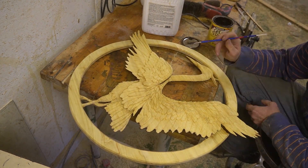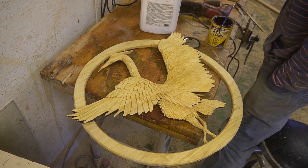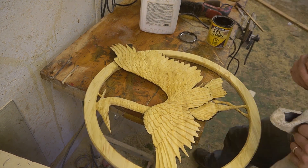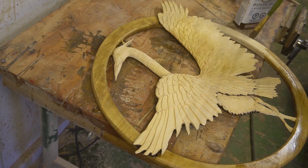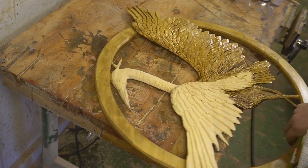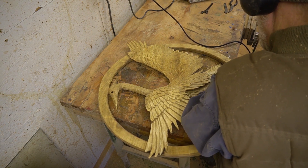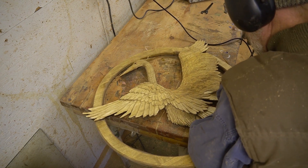Go into the hard-to-reach places with a finer paintbrush. Then put some Danish oil on — it's an oak finish. I'll put it right across the whole carving. It just makes the cut lines pop a little more and preserves the wood. What you do to one side of the carving, you should do the other side, because if it's not treated on one side and draws moisture, you could get warping.